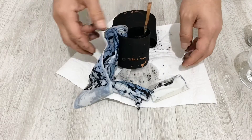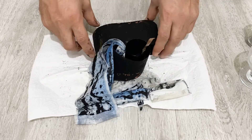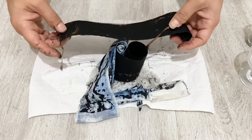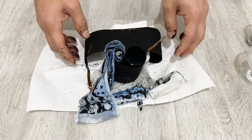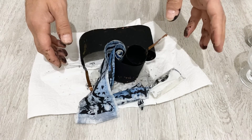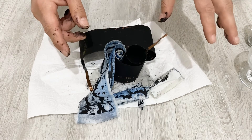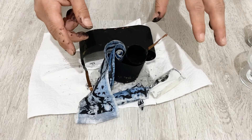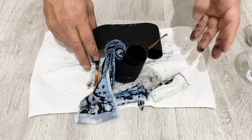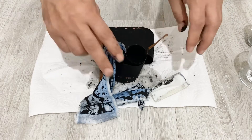Now let me tell you how you can make your own homemade supercapacitor. In order to make it, you need two pieces of current collector. You can use copper foil or aluminum foil, but you must choose the correct electrolyte to match. For aluminum foil, you can use sodium sulfate, but don't forget you need to use a surfactant material. For copper foil, you can use sodium hydroxide or Epsom salt — both will work with copper foil.